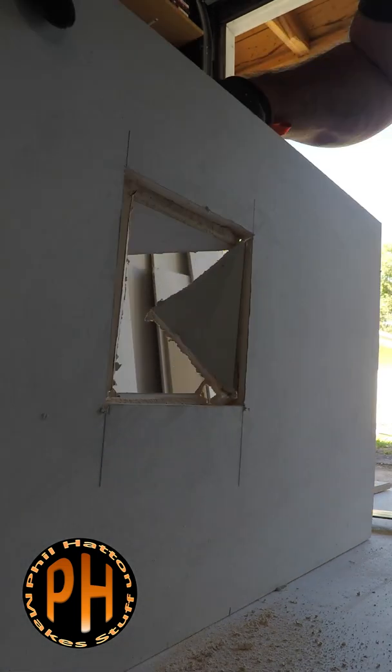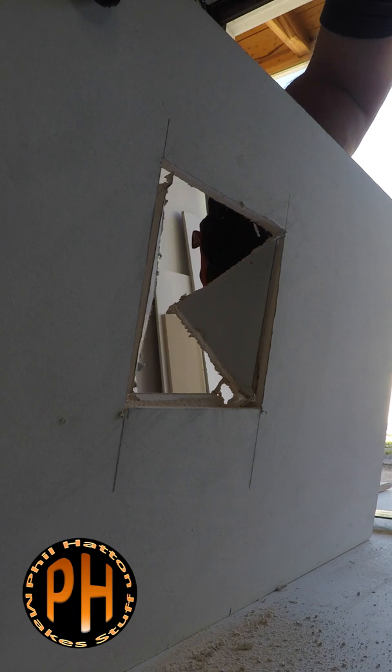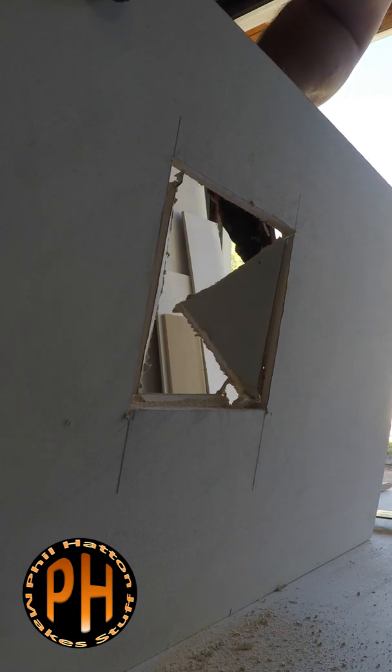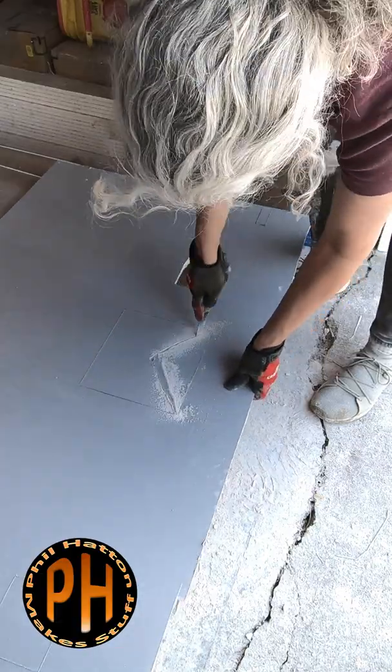You probably will want to cut the holes slightly large since it is pretty easy to be off by a little and you want to avoid the dusty mess of cutting and scraping to get the hole in the drywall to align with the box.